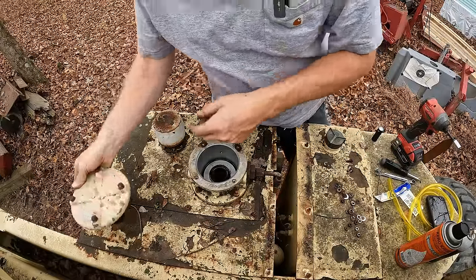See that, though? It's working. Well, it took me probably over an hour there, but hopefully you guys can tell I actually got this tank pretty clean doing my little squeegee method there. Then I'd blow it around with a compressor, rinse it with a little bit of fuel. I think I probably went through about 2 gallons of fuel, and I just kept rinsing it and squeegeeing it and blowing it around. And now the fuel tank's clean enough to where I don't feel like we're going to clog the fuel filter in the first 5 minutes. So yeah, we're going to send it. I believe that means it's time for some fuel in the tank.